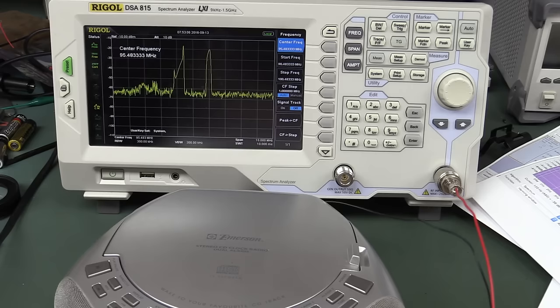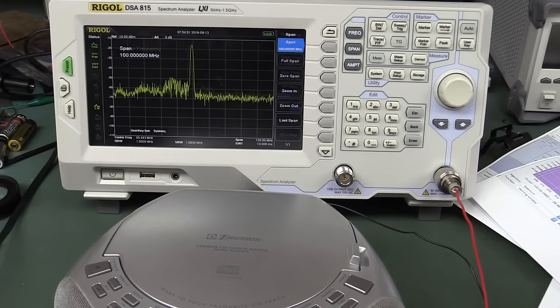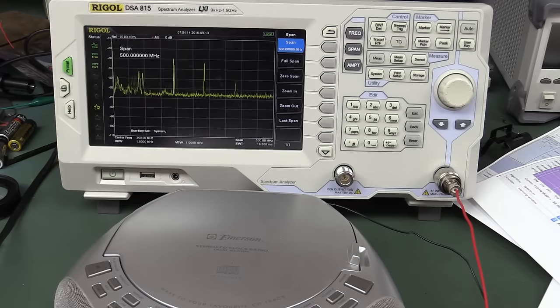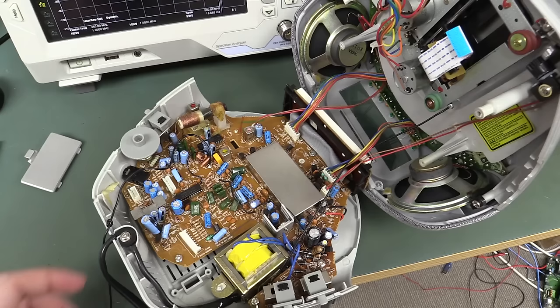2002 vintage. And sure enough, I've just got the input to the spectrum analyzer here, intertwined with the antenna - the FM antenna on this thing. And sure enough, look at that - that is huge. That's minus 20 dBm at 95.5 MHz or thereabouts. Wow, it's jumping around like a jackrabbit too, and there's a 100 megahertz span. That is terrible. If anyone's ever seen a failure mode like that in an FM radio, let us know. That thing is damn well transmitting at quite a reasonable power.